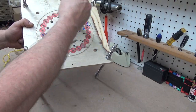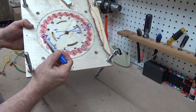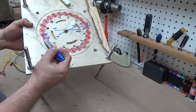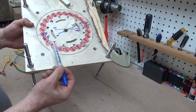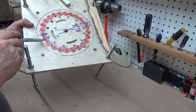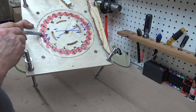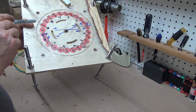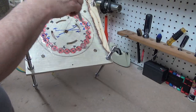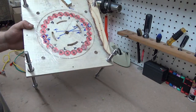Because I only had six magnets, when this thing fires, that magnet is somewhere over top of — or just past dead center of — coil one, which is a repulsion to the magnet. When that fires and induces current into these inductors, this one becomes a push and this one becomes a pull. There's no magnet over top of this coil set or this coil set — just the same coil set on either side each time it fires. That's one of the many configurations, and probably the one I used the most.